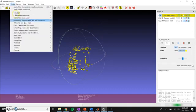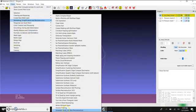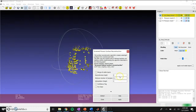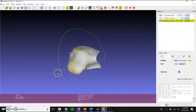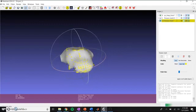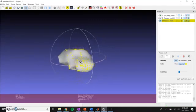So to create a mesh, I went to Filters, Compute Normals. I used a neighbor num of 14 and a smooth iteration value of 1. And then I went to Screened Poisson Surface Reconstruction, and I used a reconstruction depth of 10, minimum number of samples of 1.5, and interpolation weight of 4 to get this result. You can see it has the general shape of a helicopter, but definitely has some blemishes.